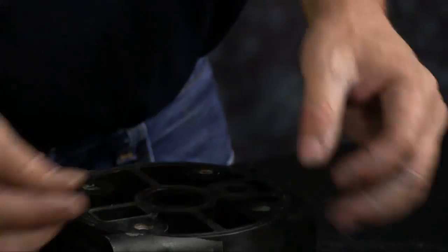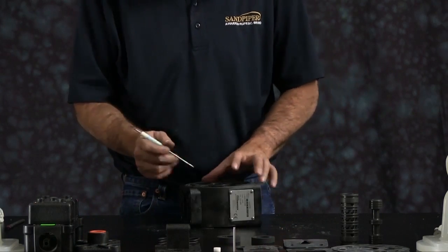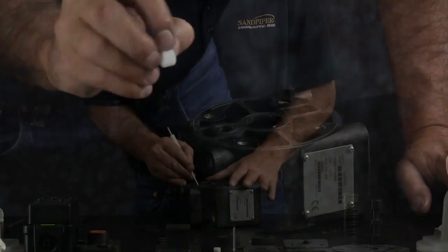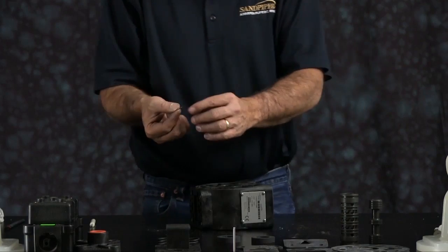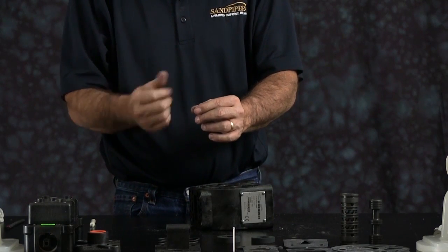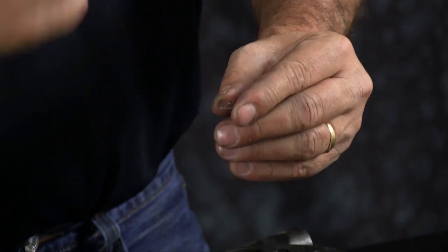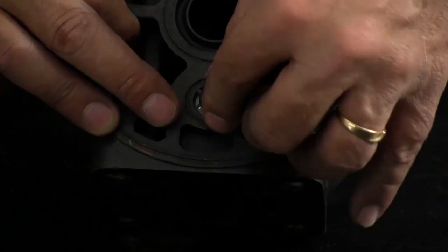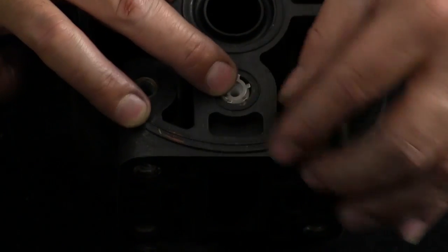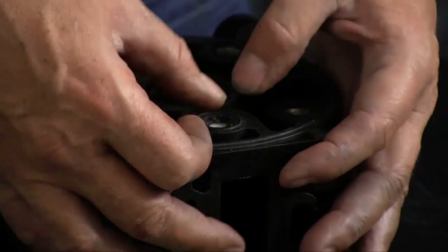Then your O-ring into the bore for the actuator plunger. Make sure the O-ring is fully engaged into the receiver down at the bottom of the bore. Your bushing, press it all the way down. And then your star ring. The star ring is concave. The open cup face of the concave star ring needs to be pointed upward. Press the star ring in and then make sure that all the fingers on the star ring are fully engaged below the lip in the bore.